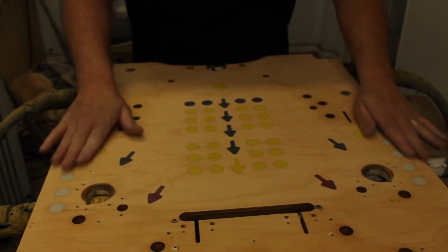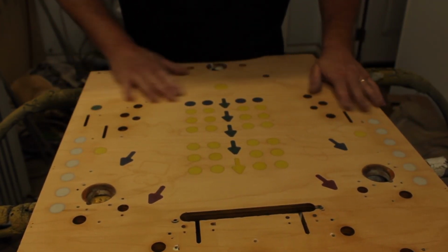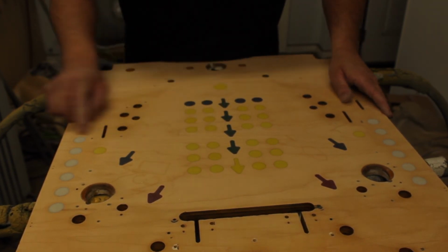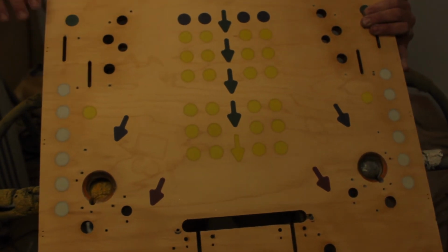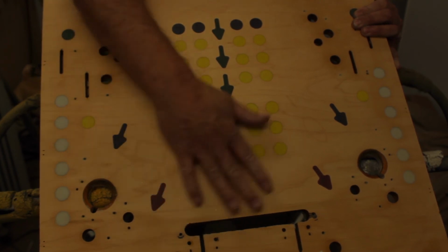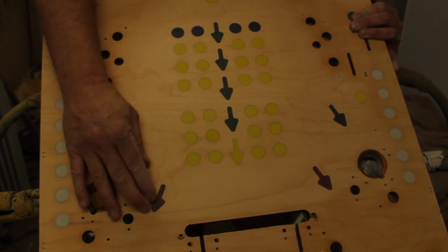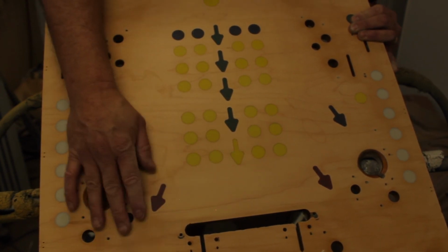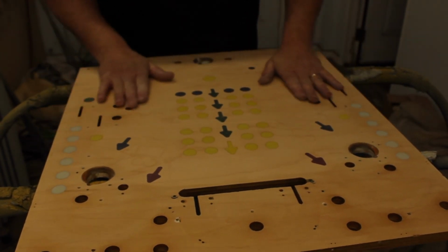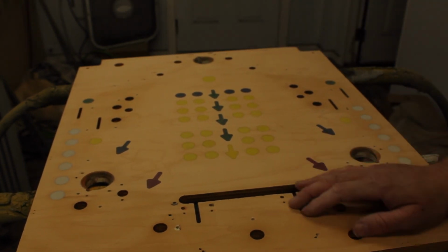Then you're just going to work your way down now, or actually up, to a higher grit paper so we can prep this for clear coat. Because right now you can see, if you look at the actual pieces, you can see the actual 80 grit scratches in the inserts. You want to finalize this with 400. 400's fine to clear coat over. And it'll also make these inserts nice and smooth, no sand scratches, and that's about it. Alright, let me go get some more paper and we'll start working our way up in numbers.